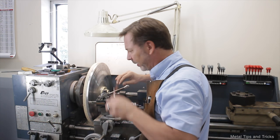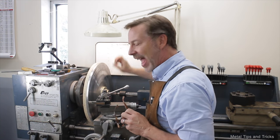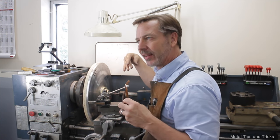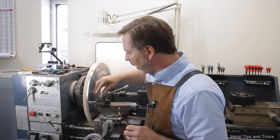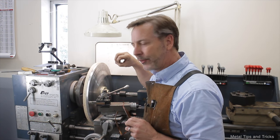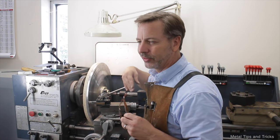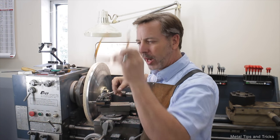The finish is a lot better now. As you can hear, it's really heavy on one side and no cutting on the other — that's why we're doing the back side, and we're going to hope that it balances the wheel enough. Right now I've got a cutter on here, 16th of an inch radius, and I'm trying different cutters. I was able to use a sharp point before to cut through. Now I'm going with something that has a lot more surface, and what I'm hoping is that with more surface cutting and that radius, it helps throw off the harmonics.